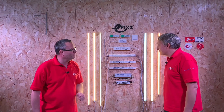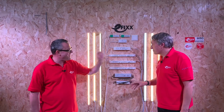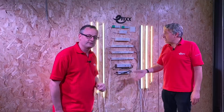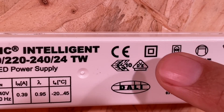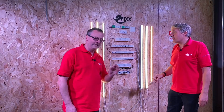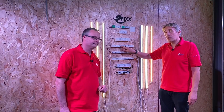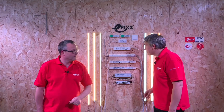We see a lot of products from overseas and online retailers — can anyone just stick that sticker on their stuff? The CE mark is perhaps a little bit tarnished these days, because there's a lot of product that has it on that may not have been fully tested in a laboratory. The ENEC mark, however, means it's been tested by an independent laboratory to meet all the standards required for the European market. It's a traceable standard, and the number next to it — there's a 10 there — will tell you what country it's actually been tested in.